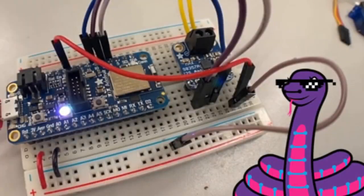We'll play this full video later, but we got MP3s going on CircuitPython devices. Very cool. This just means you're going to be able to do a lot of cool projects. We had wave playback, which is great, but waves are kind of big, so now we have support for compressed MP3 format because MP3 is out of patent. Which means that we can now ship software or hardware with MP3 decoding on it. It only will work on the larger boards like the M4 or the NRF52, the more chunky boards, not the M0 series. And you can play up to 2 MP3s concurrently.